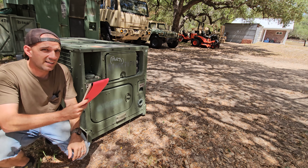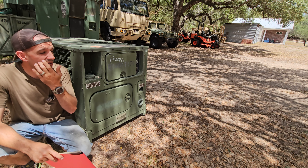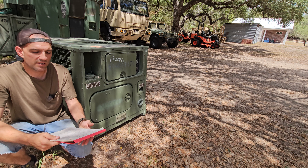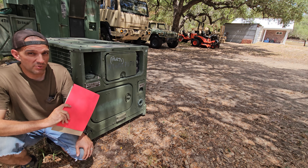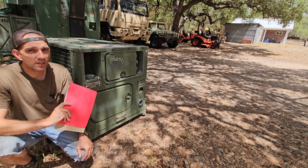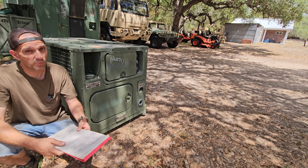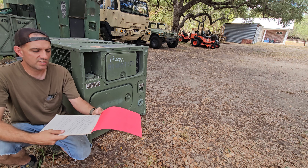It's a pretty big defect to basically just let it eat itself up like that — it's not like I had the battle short up. As far as working on this compared to some of the older generators, I found most everything on this way easier to work on. Changing the radiator on a MEP 802 versus this one was night and day. But certain things on the control side because of the screen you simply can't repair — you're basically going to have to get a whole new screen, and parts are expensive and won't be as easy to get since it's an in-service generator. You could probably go to Cummins or any dealer with a part number, but anything Cummins indirect is very expensive. So for the burnt-out stator I could probably get it, but it's going to be expensive and I don't have that much money into this. I'm going to let it sit until maybe I see another parts unit pop up.